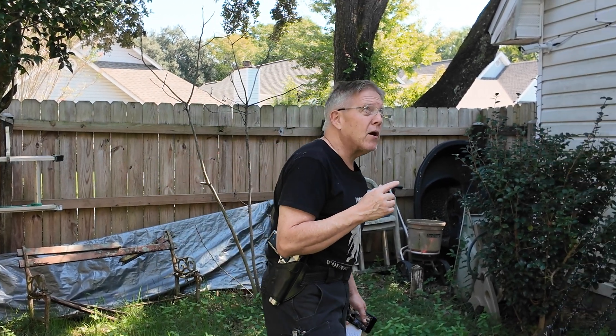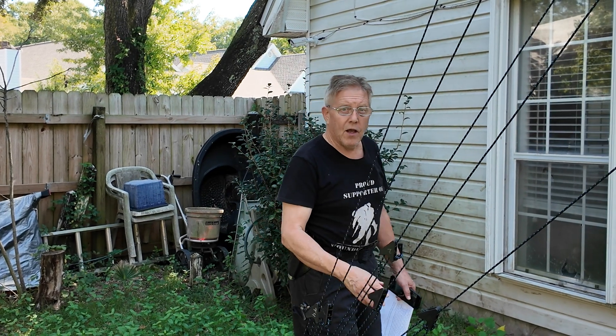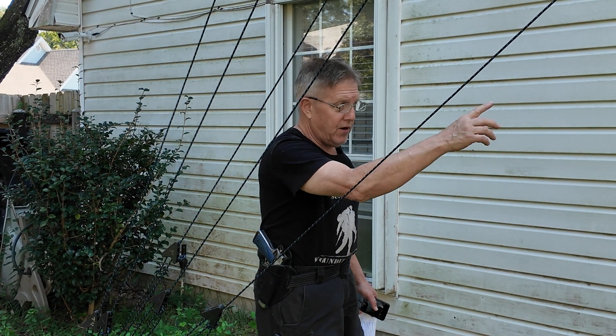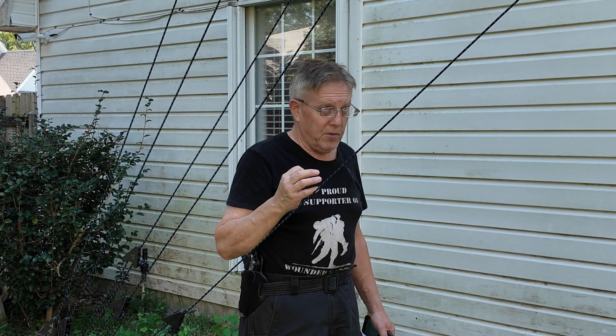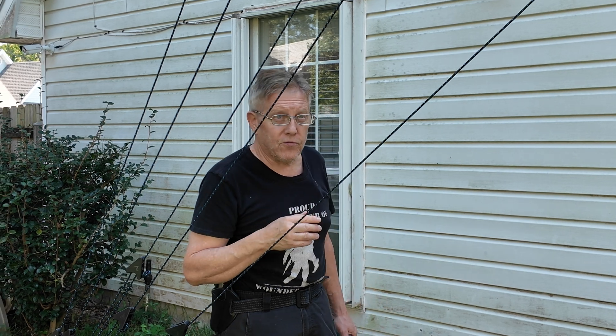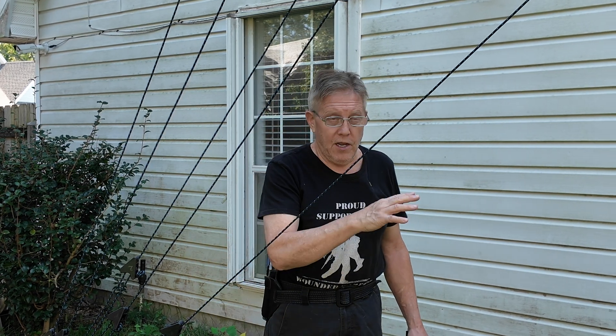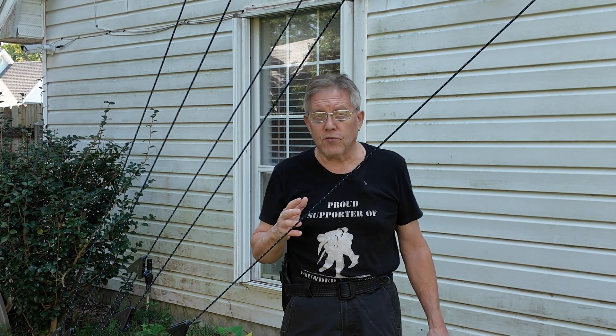Going back to the guy lines — at the very least you can inspect from the top of the guy line down, and you can get a couple of people on the ground to visually inspect the guy wires from different vantage points. If this were a towered structure, I would have a couple of assistants and one technician up on the tower to inspect from above looking down, and a couple of eyes on the ground looking up to make sure everything is fine.